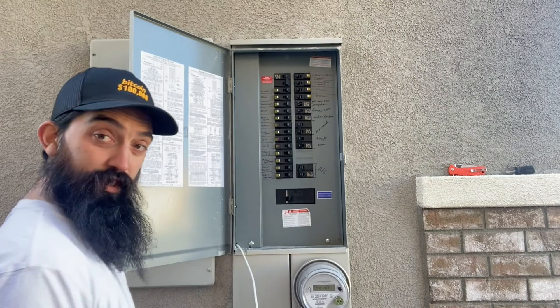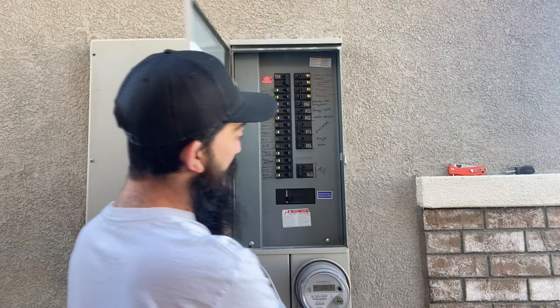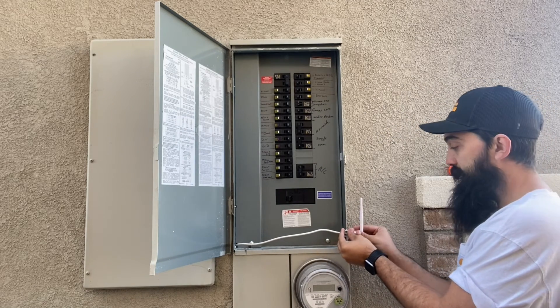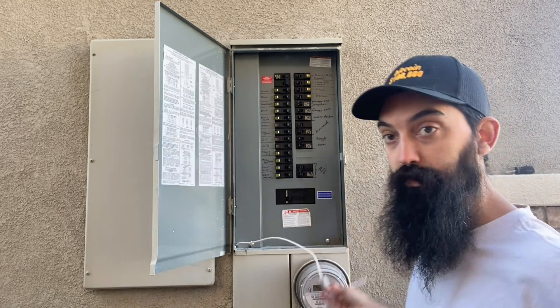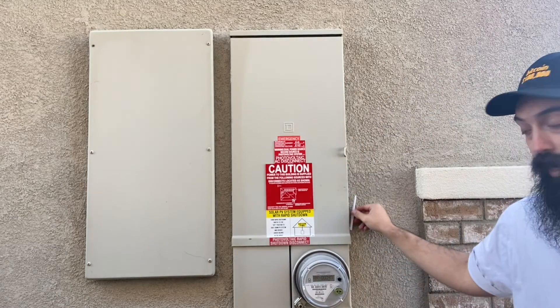I'll document this part for Sense users — a repeated question is where to put the antenna, which can be tricky. I'm dealing with an outdoor panel in stucco with no way to do the knockout and feed it out. So I'm going to carve out a spot in the metal and have the antenna sticking out from the outside so I can still lock the panel. It's tougher than it needed to be with the tools I had, but it slides all the way in and the panel can fully close now. That's it, thanks for watching.